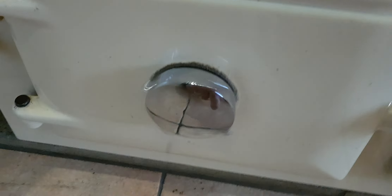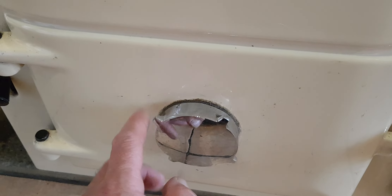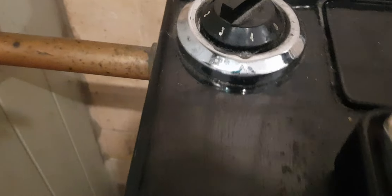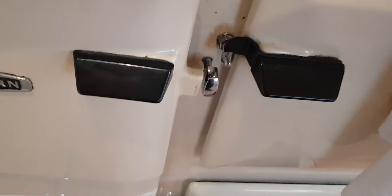Let's have a bit of oven and a bit of heating, but we've got wood in it - let's turn it down. Now it's hot, look - just a little bit, it's just open. The damper at the moment is shut. It's hard to do it a little bit with the door open because it's letting excess air in. Up top here, my heating control sits on about just under four - you can adjust that to suit. That lets the air go in down the side there, and that's what burns away your fuel.